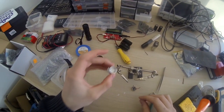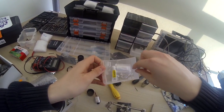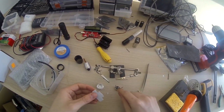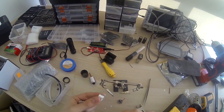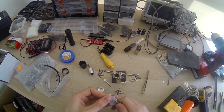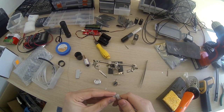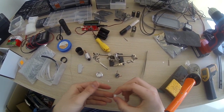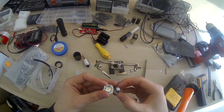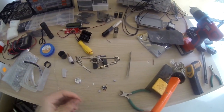It's best if we use some heat-spreading pads first. I don't know the exact name, but we put some on there so it makes contact here, and the whole pill acts as a heatsink for this driver - because the driver outputs quite a lot of heat, not just the diode. I'll layer two of them - should be enough. Doesn't need to be perfect but it's better than nothing for heat sinking the driver.